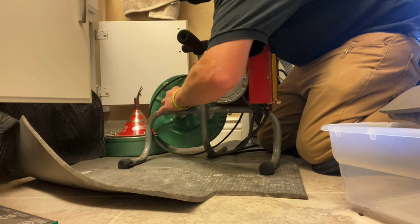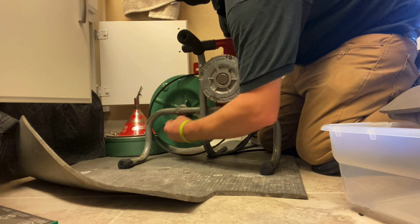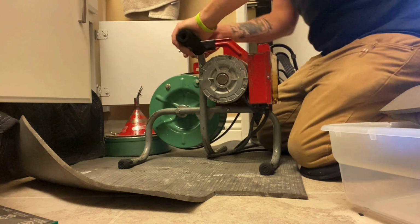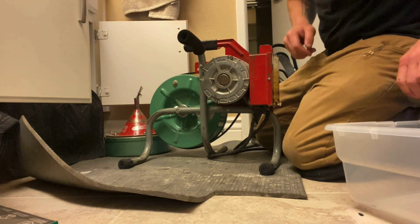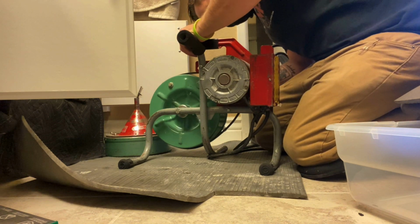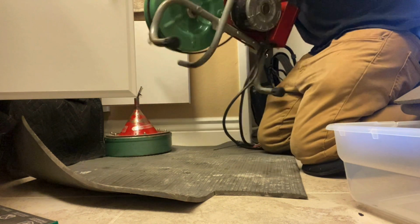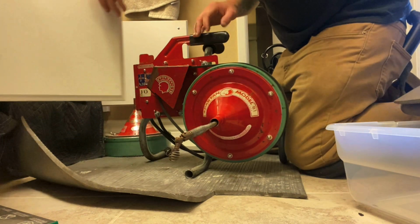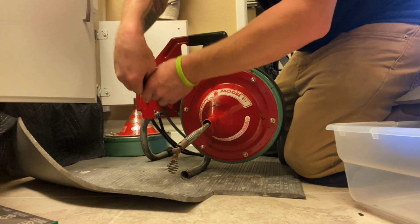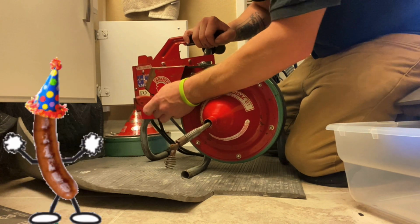So once you throw the new drum on and it's attached back to the frame, you just throw the belt back around the drum and you put some tension on it by pulling the motor away, and then you tighten two other little thumb screws and you're back in business. The red portion of the machine is on these little slides, so I'll use my knife or a pry bar, anything. The handles of my channel locks I'll stick in between the drum and the red portion to pry them apart, to put some tension onto the belt and tighten the two little thumb screws in front there, and you're ready to go.